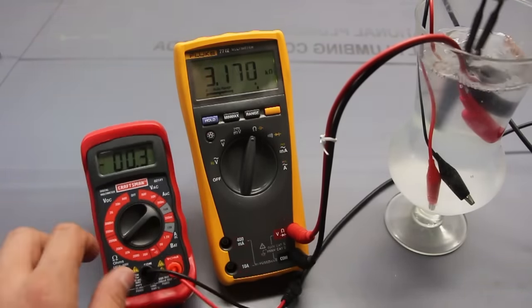So it's conductive there, not conductive there, not conductive there. So in other words, closed, open, open. All right, so now here's the audible rather than just looking at the resistance. Closed, open, open. So that means that potentially these two, when this kill switch is activated, potentially these could disconnect and these two could connect. I don't know. But thus far what we know is these two are connected, these two are not.